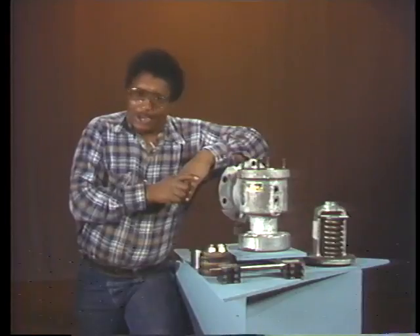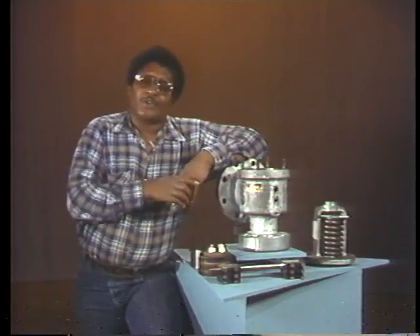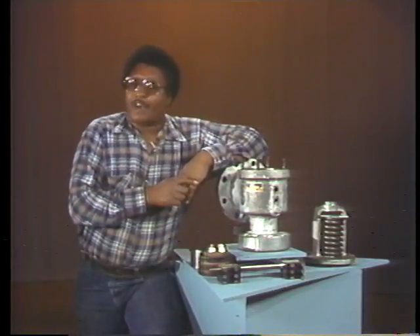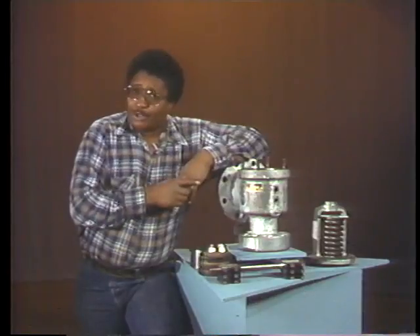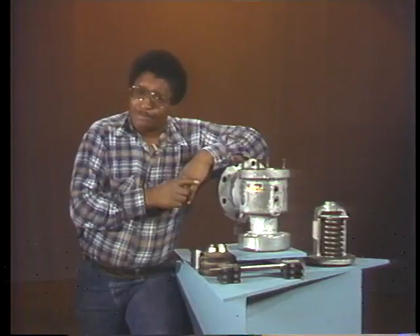After cleaning, inspect each part carefully. The four parts that deserve the most careful inspection are the feather, the seat, the adjusting rings, and the spindle. Let's consider each one in turn, identifying some common types of damage you're likely to see and discussing what to do when you find a part that's worn or damaged.